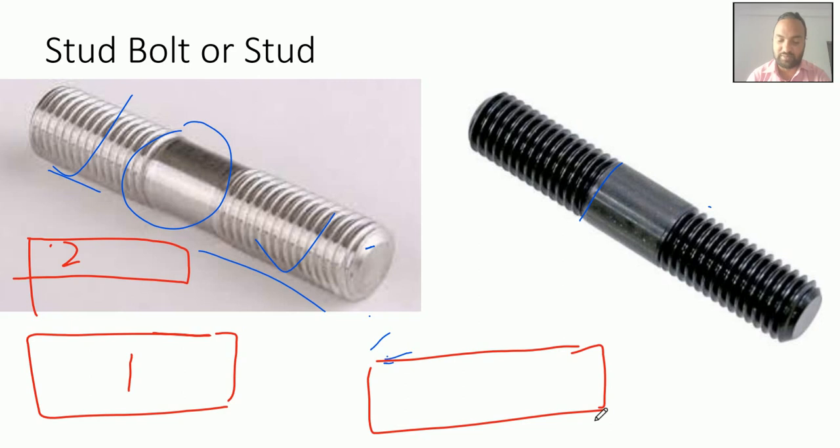Why is it called the metal part? Because on this side you will insert the metal end. So you will drill a hole, and by a tapping operation you will create an internal thread in that hole. Next, you will put this side in and screw it. So what will happen? I am showing you the position. It would be like this way.